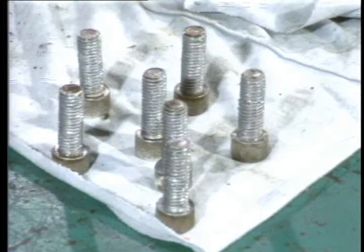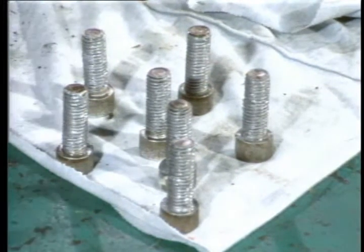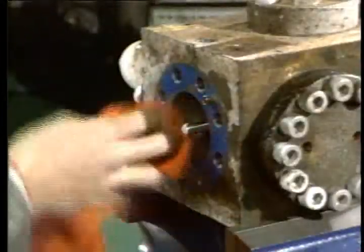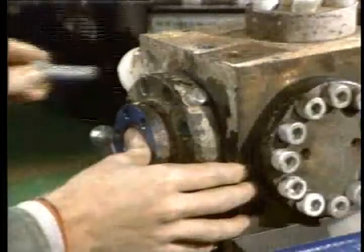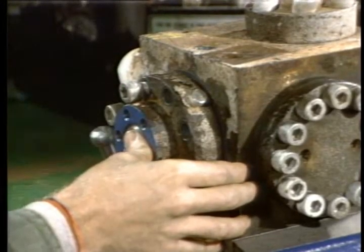As you're replacing a flange, coat only enough cap screws with anti-seize for one flange at a time. Don't do them all at once. They'll sit around and collect dust until you can get to them. The pilot valve body. If by any chance you forgot to mark this flange, it's no problem. This piece of metal is part of the vent passage, and it'll act as a guide pin when you put the flange on. So the flange can attach one way and one way only.